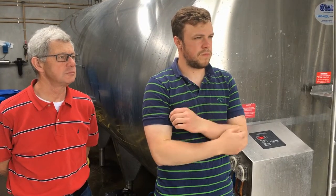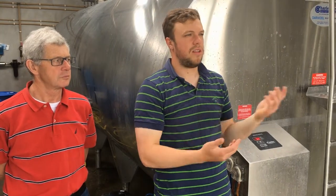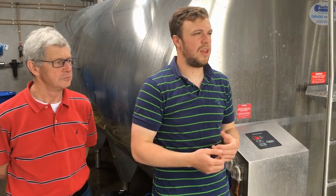So you have three probes set up on the milking parlour, an automatic washer on the plant, and an automatic washer on the tank. You really need those three probes to make sure everything is working correctly, especially when you're not there — if you have a relief worker in, things can happen or the bulk tank might not be turned on, and you get a notification for that.